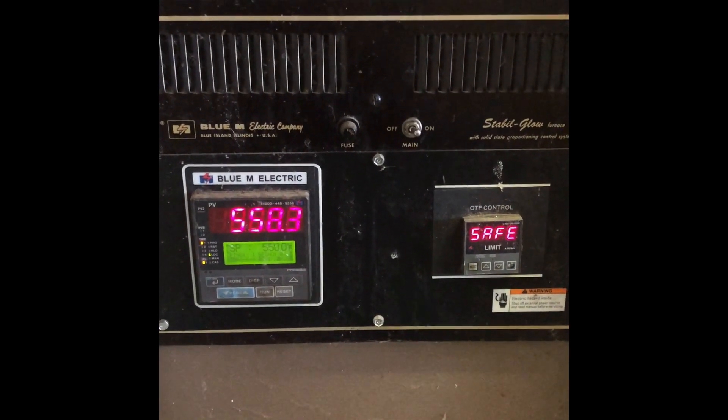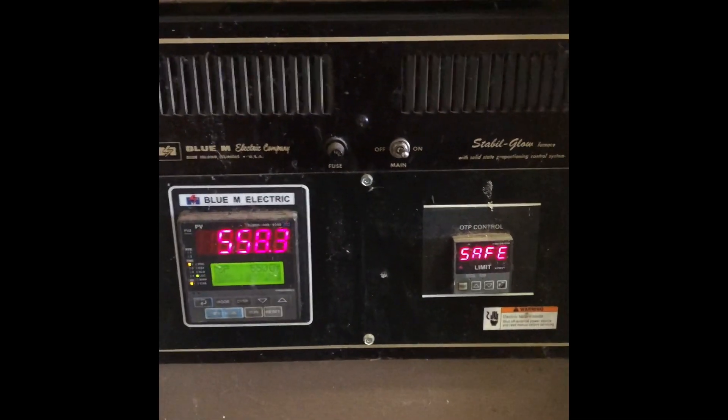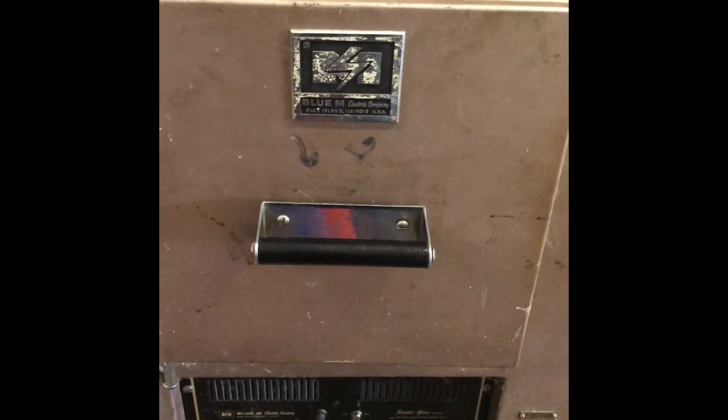It's been about a half hour and I figured we'd check on the parts. Also, after I signed off before, I decided to put a second one in, which we're going to heat up to 590 degrees to get more of a blue color. Looks like we're starting to see some color change on those. We'll leave them in there for another half hour and then dial up the oven after we pull out the first one.